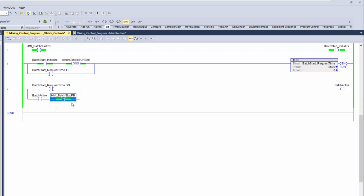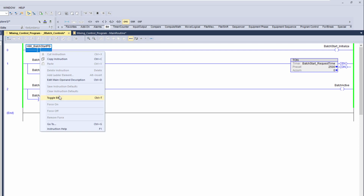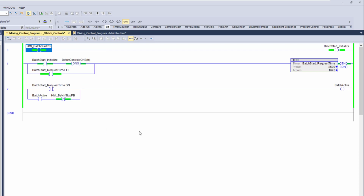Now, for the sake of what we're doing, see this one shot? This is the exact reason why I did it this way. If somebody were to hold the button on, or if you had a communication lapse, or something with your HMI that failed to work, or an HMI sticky button, or something of that nature where the button sticks into a state that is uncontrollable, then you have a one shot right here, just like I just showed. So it would have to be depressed again and then started again before it actually worked. So this is the reason why we do it this way.